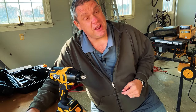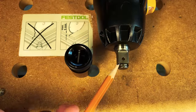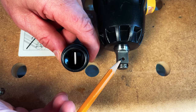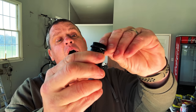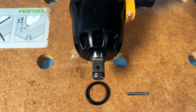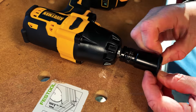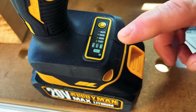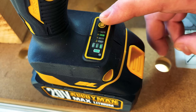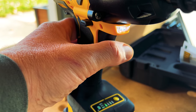I've owned a lot of impact drivers in my time but I've never owned an impact wrench and this has got just a little bit different design. If we take a look at the head of the wrench you can see there's a little hole, and if we look at the socket there's a little pin that goes directly into the center of this hole. There's a small rubber band on the very end of the socket — remove the band to remove the pin, then place the socket on the wrench and replace the pin and rubber band. At the base of the tool there's a lit display showing the battery level. You can also change the impact level from high to low to medium, and it displays the direction of the tool's rotation. The tool also has a small light at the bottom so you can see where you're working.